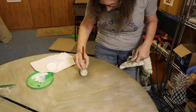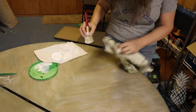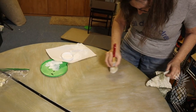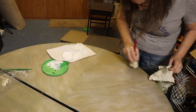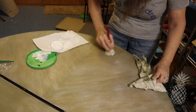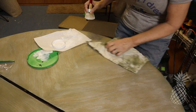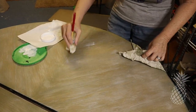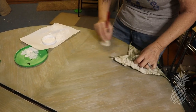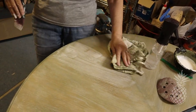After I put that layer of green down, I didn't really like it — it was just a little bit too green. So I tried using some of my white wax and just going over it to kind of mellow out that green color. Unfortunately I didn't like the way that turned out either — it was just too splotchy. So I did kind of sand it down, then pulled out the white paint, watered it down, and did a white wash over the whole thing.